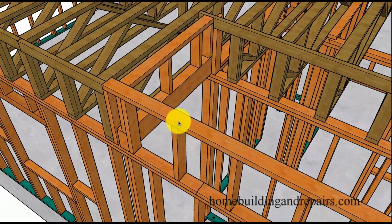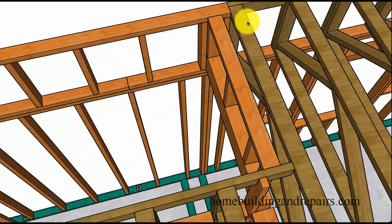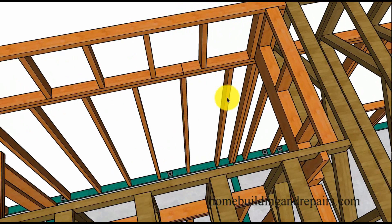Now if you're wondering why I didn't do that in the example — well, what can I say? Live and learn. So here we have a 4x6. I believe this is a less than 4 foot span here, and of course this will be supporting the wall up above it. Simply frame your jack studs or cripple studs, whatever you call them, on top. And we've got double studs supporting the 4x6.